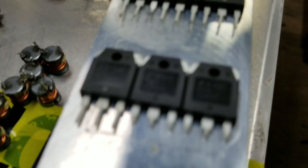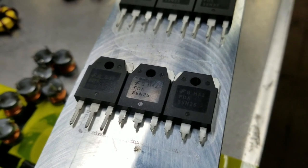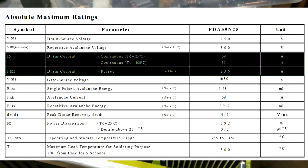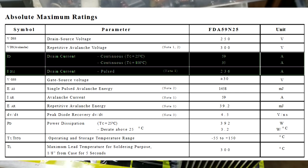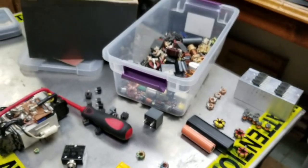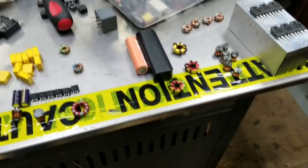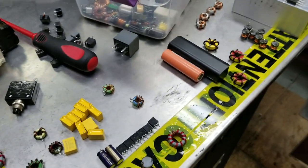We're going to make another one now. This one will utilize not two, not four, but six MOSFETs. These are 59N25, I believe — 200-something amp pulse current, or something like 30 or 40 amps continuous. We're going to do some magic wizardry here and make this work. As you can see, this is still in an early prototype stage; I have no idea how it's going to turn out. The components are just on the table and I'm sorting out issues with matching the MOSFETs.